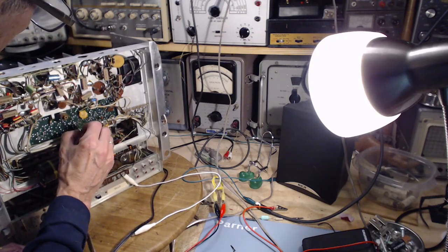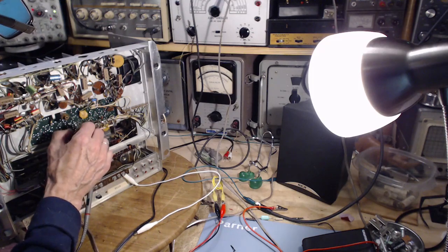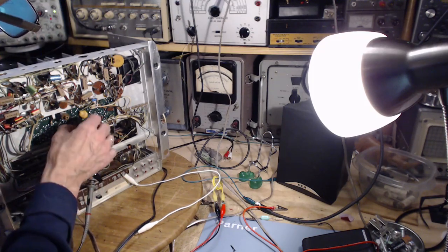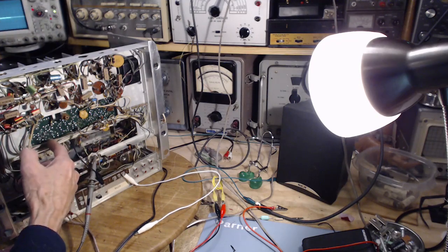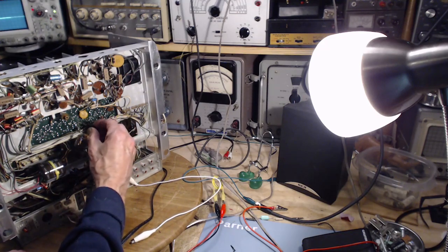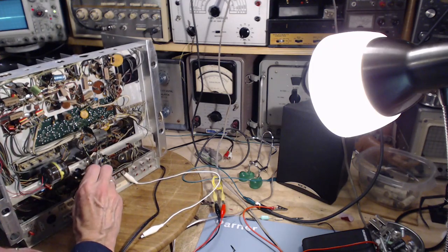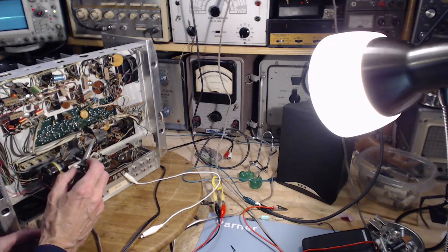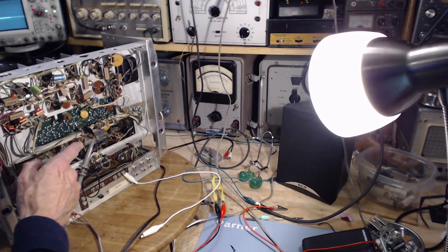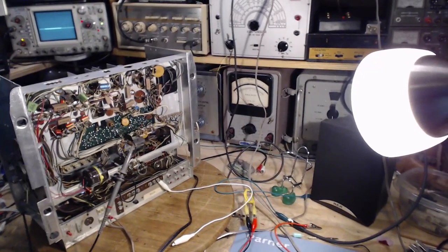Yes, there's a grounding test point that's not mentioned in here, and this is test point 1 we're hooking up to. Test point number 2 does not exist as a test point. There's nothing there to find. Yeah, that's why it took me some time. Okay, we'll put that on the ground. So this little interface circuit is actually supposed to be a small detector circuit. And so we should see, well, we'll see what we're going to see. Leaving everything else alone, hit the switch.